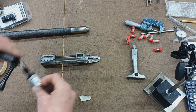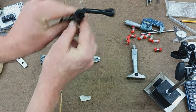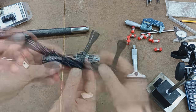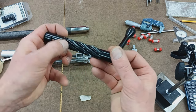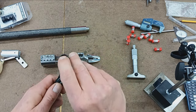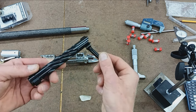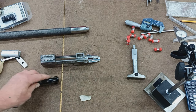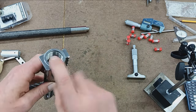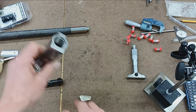Okay, with that out — very nicely machined bolt. I believe these are all machined out of one piece of steel as well; it's extremely light, with very nice spiral fluting cuts all around the bolt body, and more skeletonization with a hollowed-out bolt knob. Again, with the action, you've got a standard Remington-style 1-1/16 by 16 thread tenon. They do provide a nice big relief groove on the inside so it doesn't have to be cut into the barrel, which is nice.